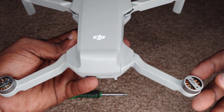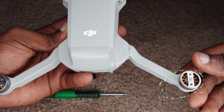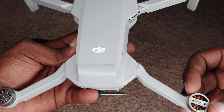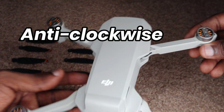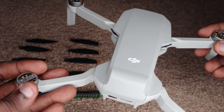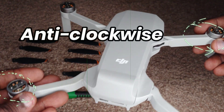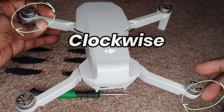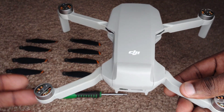So for example, our back right motor will give us a clockwise turn. So when we arm these motors, it will spin this way, and these motors will spin anti-clockwise. Now something important to note: the motors on the diagonal side — this motor and this motor — will spin in the same direction. As well as this motor and this motor will spin in the same direction. But not all four motors will spin in the same direction.